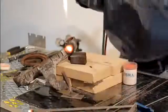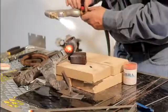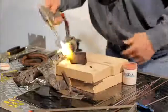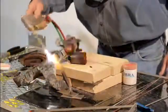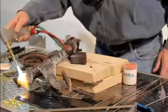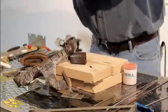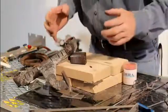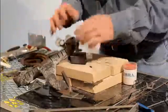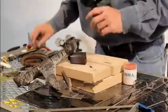Now when you get through, on a smaller piece like this we can go back — usually with our number two or number three tip, or get that new Cobra rosebud — and post-heat it about four, six, seven hundred degrees. You want it to cool real slow. Some guys put them in sand or lime. We've actually used — I hate to say it — cat litter. You can wrap it in aluminum foil, you can put household insulation. You just want that cast to cool very slowly.